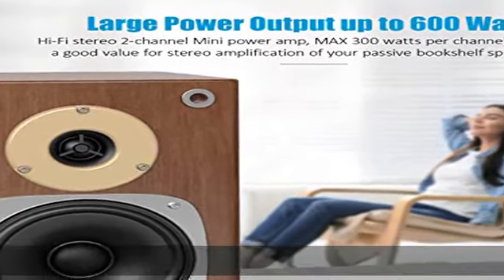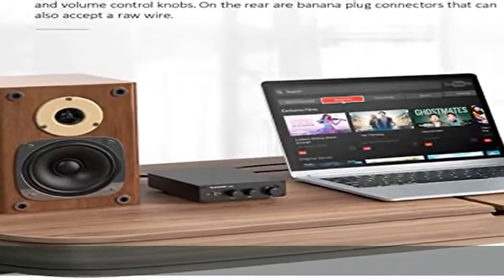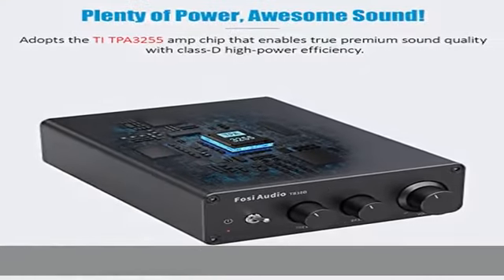The device is operated in AT mode and can drive up to 2x315W into 4-ohm load at 10% THD, and 2x150W unclipped into 8-ohm load.